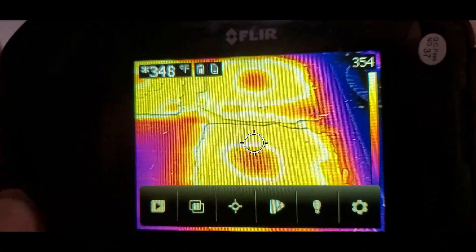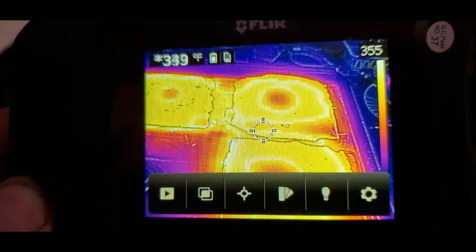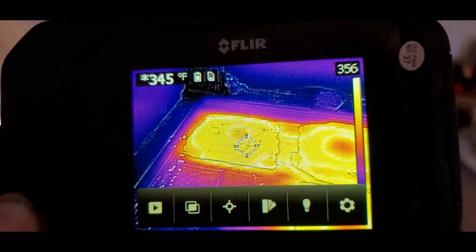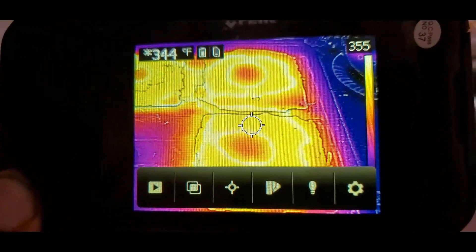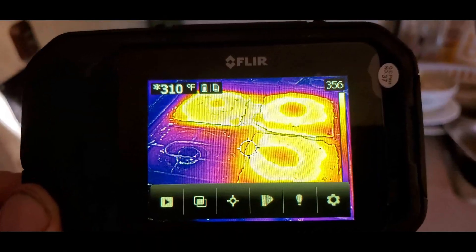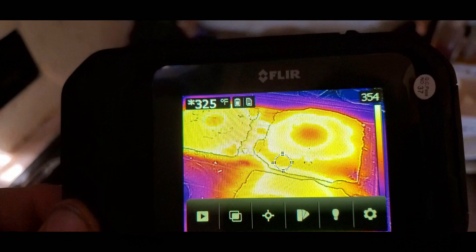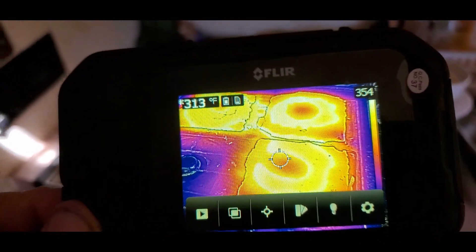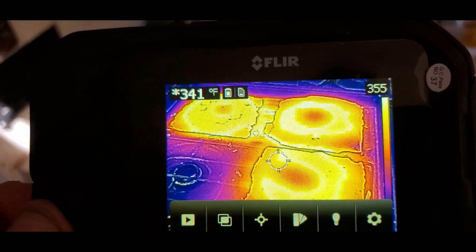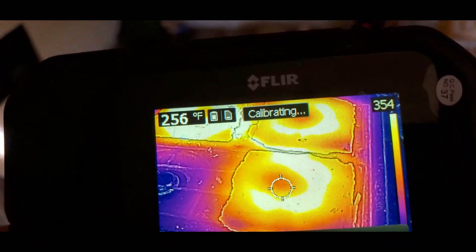If the idea is to reflect heat and reflect cold during winter, you can see if you just have a normal sand-cement mix it will heat up, whereas the samples with ceramic beads will also heat up but much more slowly. By adding this coating to the exterior of the dome as a thermal barrier, and then adding ceramic beads into the paint and painting the interior of the dome, you get a big thermal barrier. It's not insulation, but it is a thermal barrier.